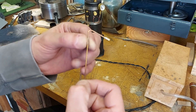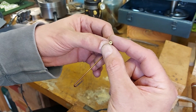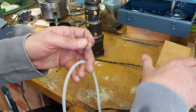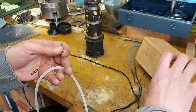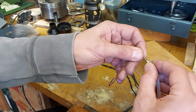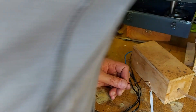My alternative steam raising device is a piece of 1/16th inch copper tube bent with a hockey stick shape on the end, and then with a slightly bigger inlet here to accept a piece of silicon tube from a very small air compressor which is in this little box. It's a little 12 volt seat pump that supplies around about 10 PSI of air - fairly low volume.